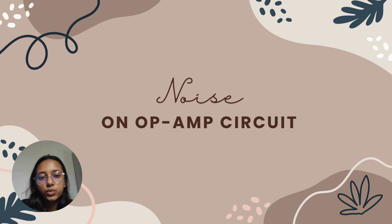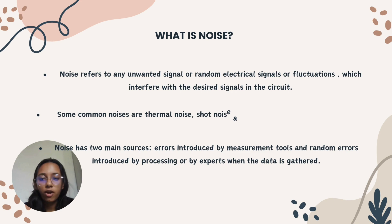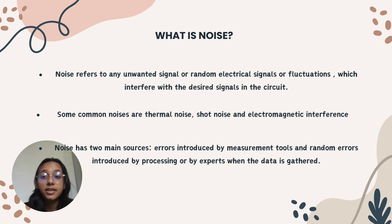Hello, my name is Ternisha and I will present about noise in operational amplifier circuits. Operational amplifiers are very sensitive to noise and interference that can decrease performance and accuracy. Noise can come from various sources such as power supply fluctuations, electromagnetic fields, thermal effects, or component mismatches. Noise refers to any unwanted or random electrical signals that interfere with desired signals. The experiment may interact with noise, altering the data — the noise effect can be assessed by calculating the percentage of error compared to theoretical results.